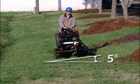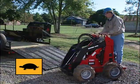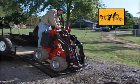Never operate the machine on steep slopes, embankments, or in ditches. And never operate the vehicle sideways on slanted ground of more than 5 degrees. When traveling up or down hills or ramps, always keep the heavy end on the uphill side.